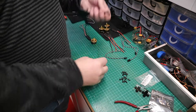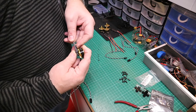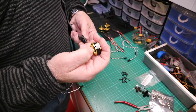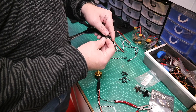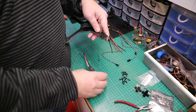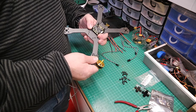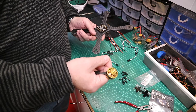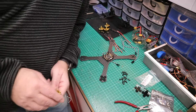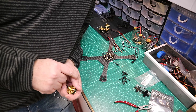If you're using soft mounts or various thickness frames, make sure screws only protrude a couple of millimeters — about two or three turns and then you're in the motor windings. Put the screw in and see how far it comes through when squished together. If the screw goes beyond the metal work of the base it's too long, so find shorter screws or grind a bit off. The soft mounts give a little cushioning to stop motor vibrations traveling through the frame to the flight controller. Tighten them up so they're firm, and use a bit of loctite to stop them unthreading.